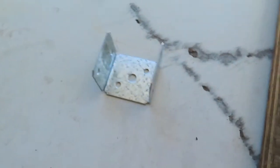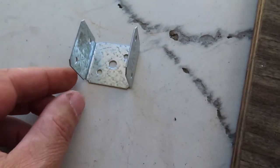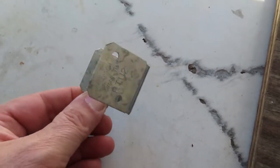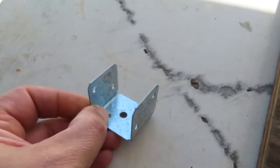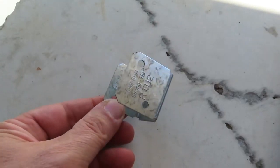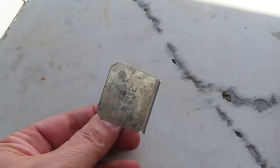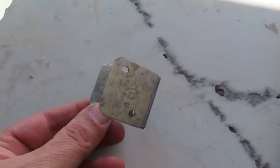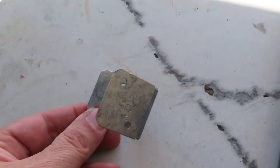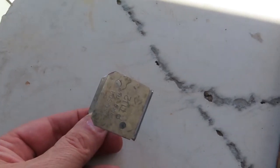Alright, this bracket that we're going to use to attach to the awning, I bought some kind of hurricane strapping bracket. I'll have a part for it in the description. But it's got offset holes on each side, and the holes are offset opposite. So if we look through this top corner one, it does not match up with another one. So that's the hole I'm going to use. First I'm going to drill through the other side a smaller 1/8 inch hole, and then I'll use them both as a guide to drill a bigger, probably 1/4 inch hole.